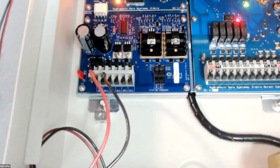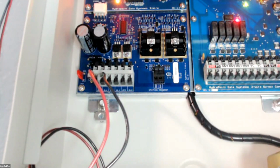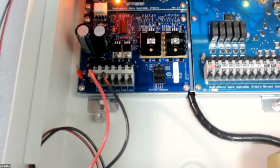And so I definitely encourage you, if you're designing a 2-wire system, to use all 3 of those ports. Have 3 2-wire paths that go out so you can isolate different sections of the property when troubleshooting. Having your site sectioned off on different 2-wire paths makes it easy to eliminate big chunks of the landscape when you go out to do troubleshooting, because you'll be troubleshooting 1 wire at a time. And so if you can have half of your system on one and half on another, it makes it much, much easier to troubleshoot. So 3 separate ports to plug in 2-wire paths. And then once they're plugged in, it's seamless, right? You don't see any difference in the performance. WeatherTrack knows how to manage all that logic.